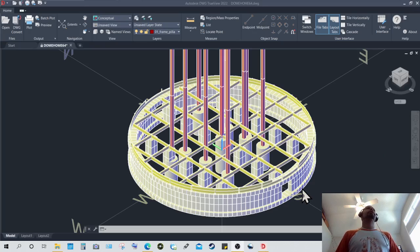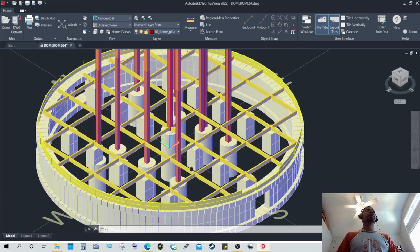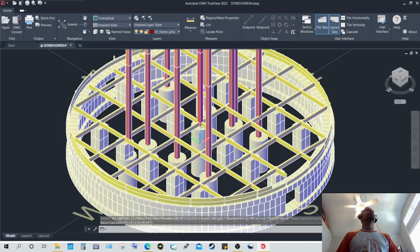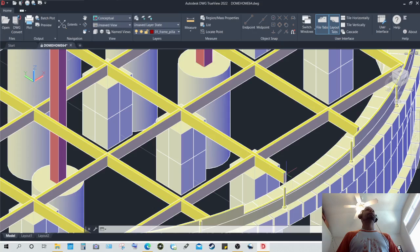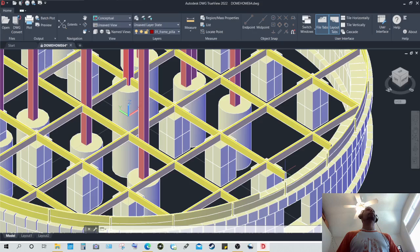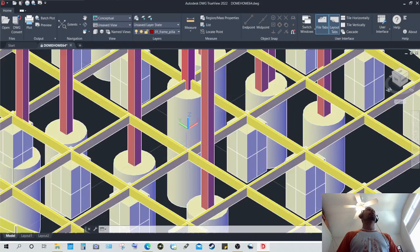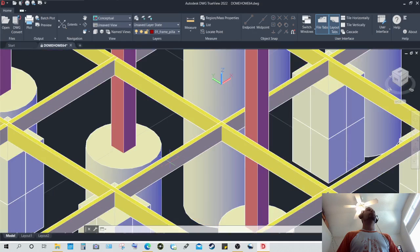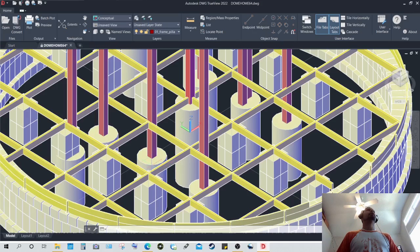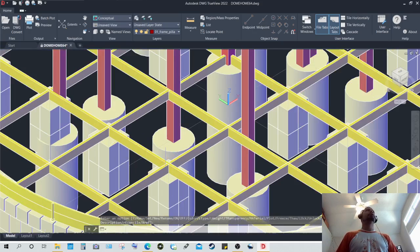Okay, so this right here is the floor frame. I just turned on the layer for the floor frame again using the DWG True Viewer. This design again was done in AutoCAD completely, and as you can see, the floor frame is designed to be built out of wood lumber members. These are 6x2s. Of course, that's not the exact dimension of those. I believe it to be about 5.5 by 1.5 inches.